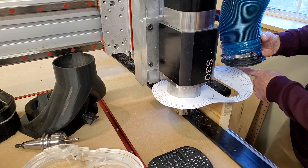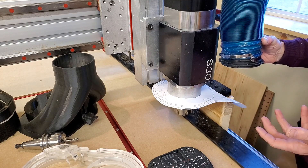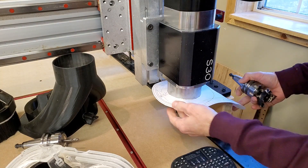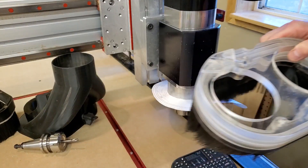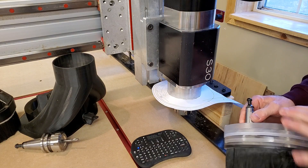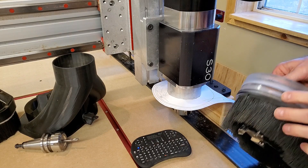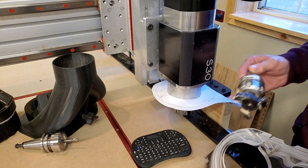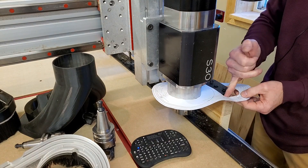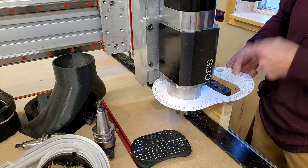The more inches of brush you have — if you're unnecessarily large — you're reducing the velocity of the air going in all around. When you make it a larger perimeter, you're going to reduce the velocity everywhere with whatever amount of air you're drawing. I also noted to add material in this direction because from the previous design and the benefit of hindsight, the bristles were all chewed up. I think when a clearancing bit was installed, the vacuum pulls the bristles in and they were just getting chopped up. So I'm going to push it that way to keep it away from the bit. I noted where I needed to start the radius to be clear to this point, and then I could do whatever I wanted back outside of what I needed for the dust collection pickup itself.